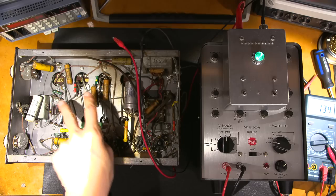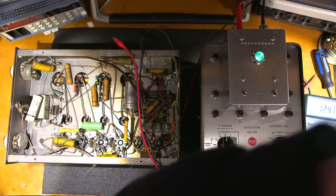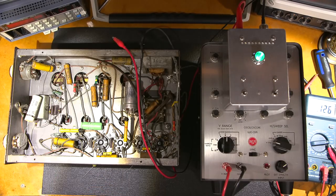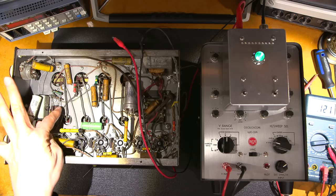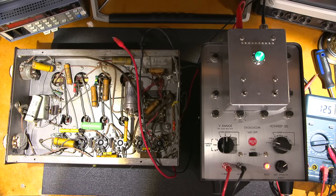So you kind of have to make an assumption. If you see two of them that are way off, I'll just move the focus over to the chassis there. There's a really good chance that this thing was stored in a very bad atmosphere. And since these things have a porous kind of case on them, they're really prone to moisture ingression. So definitely want to get those out of there.